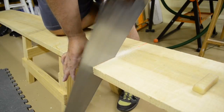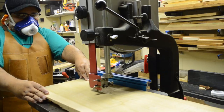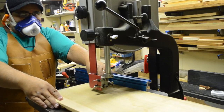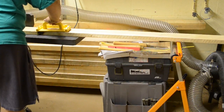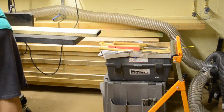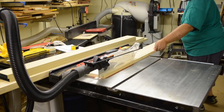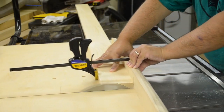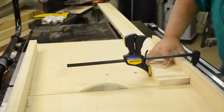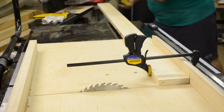It adds a little extra time to the milling process, but it works for me. Once I get it cross-cut with my handsaw, I move over to the bandsaw to rip it into smaller pieces, then to the jointer. There were some challenges with the extra-long pieces — I ended up using a roller stand for balance. Then I took it to my thickness planer, came back to the table saw, and took everything down to its finished dimensions including cross-cutting. If you've seen the most recent Matt's Basement Workshop Shorts, you may have seen a new cross-cutting technique I was trying out.